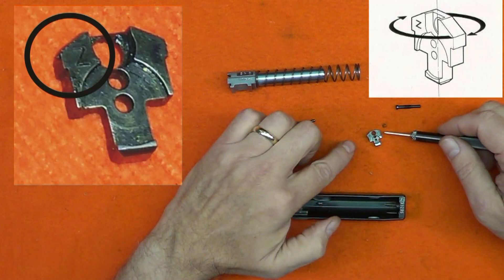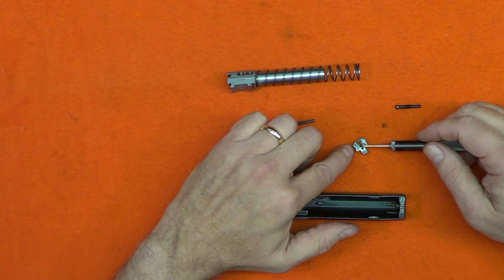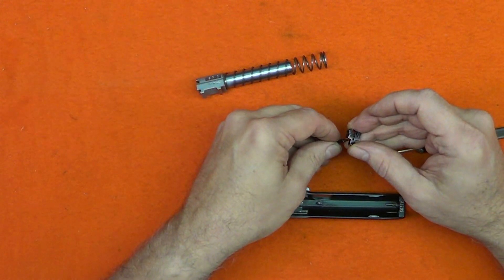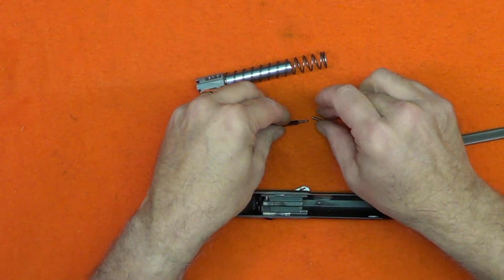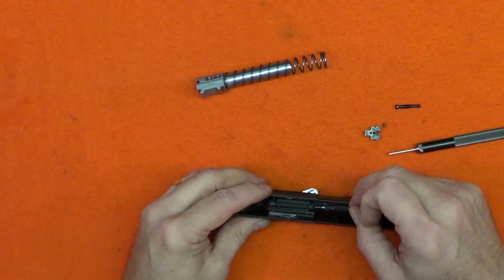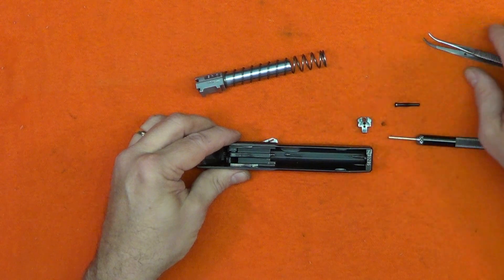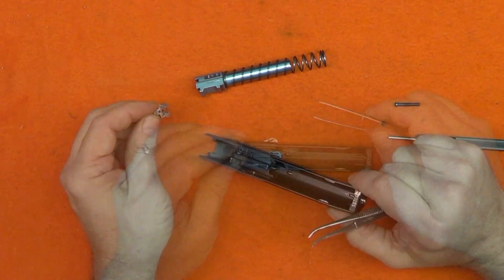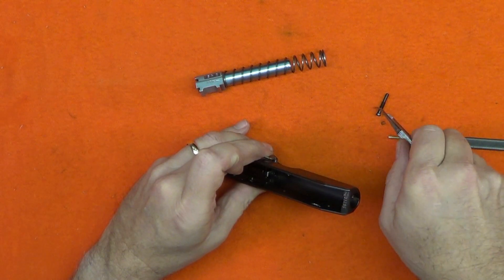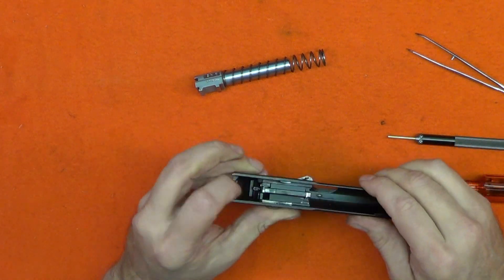Before the faceplate can be installed, it must be oriented for rimfire or centerfire operation. The faceplate is inscribed with an R on one side and a Z on the other. The R is the rimfire face, and the Z is the centerfire face. Additionally, there are two firing pin holes in the faceplate, one for rimfire and one for centerfire, and the firing pin must be inserted in the correct hole during installation. First, install the firing pin with spring — orient the firing pin with the flat spot on the hammer end facing up. Then set the safety to the intermediate position and insert the firing pin. Orient the faceplate in the correct direction — in this case with the Z visible for the centerfire .380 ACP — and install the faceplate with the firing pin in the correct centerfire hole. Keep pressure against the faceplate and firmly install the faceplate screw. Now check the firing pin for freedom of movement, adequate protrusion, and the correct hole.